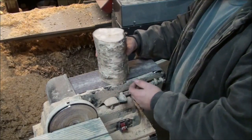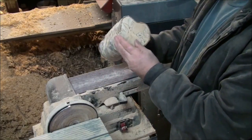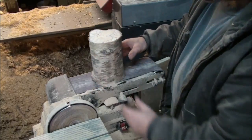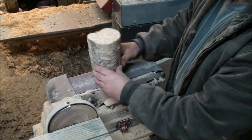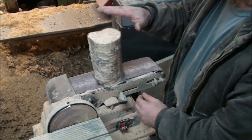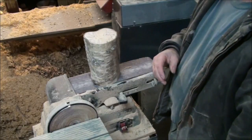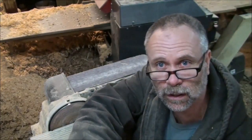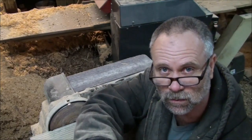It's not going to be perfect because it's one of nature's characteristics — this is a unique, one-of-a-kind deal — but I want it as vertical as possible. When I sand both sides, I'm looking for flat and as square as I can get it, so when it sits down on a table it has a flat horizontal surface. That looks pretty good, so I'm going to take this over to the drill press and bore a hole in the top with a Forstner bit.